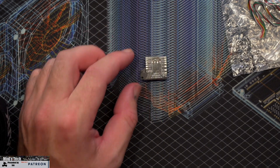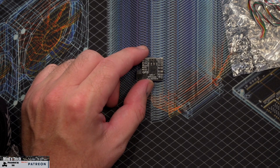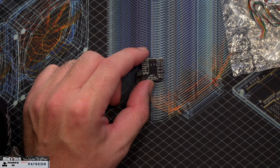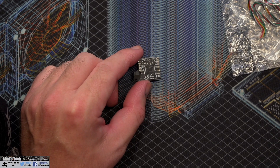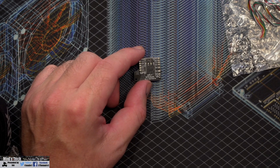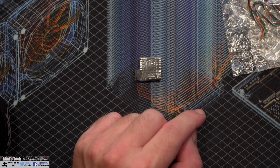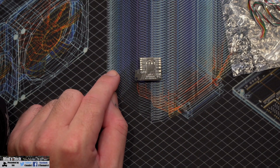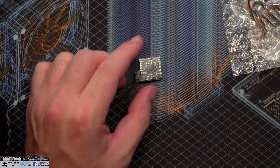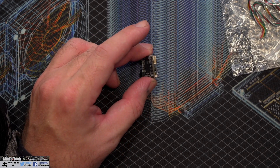On the GPS wiring side you have TX, RX, ground, SC and SD if you've got GPS and compass, and on the flight controller side you have the same connections mirrored — the idea being to wire this between your flight controller and the GPS unit. There's also an extra pin for a buzzer if you want to wire it that way.